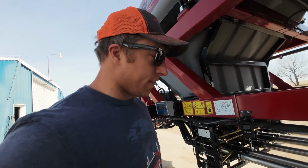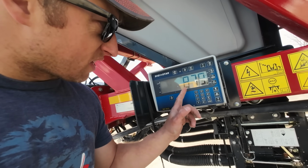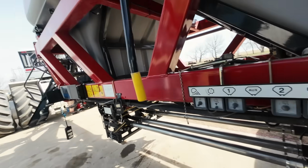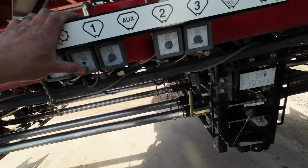So we're gonna run a calibration on the Camelina. Got the scales on right now. That's for the center tank, tank two. It says 878 pounds of Camelina is in there right now. It's all set up, the bag's in the bottom. And then I got the monitor ready for calibration. So it's on tank two, press the calibration button.